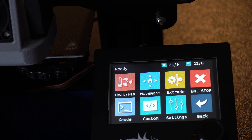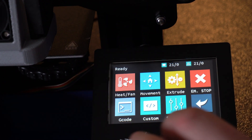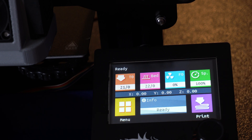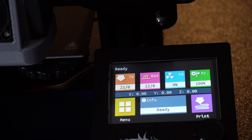I would recommend spending a little bit of time going over the menu items and everything like that. There are things here that weren't there before like the G-code section and then some other smaller things. But outside of that everything would pretty much behave the same — you just now have the touchscreen mode. I have had people say that they had issues with it not displaying the temperatures right. So far I haven't had that issue but if I do I'll let you guys know. And like I mentioned earlier in the video I'll do another video showing you how to actually upgrade the firmware on the TFT35. You might want to do that on occasion just to get some new updates, but more importantly for any bug fixes that they would be releasing.